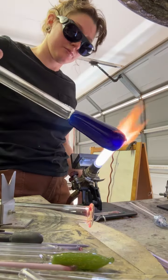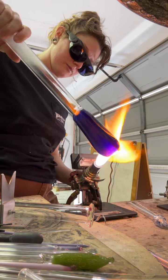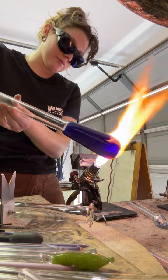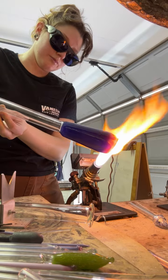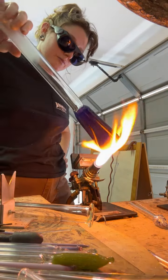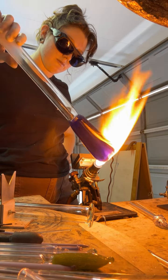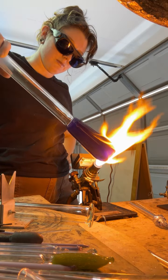All right, so now that it's done, I'm going to put this in the kiln for at least 15 minutes to allow the entirety of this vessel to come up to temperature, because we are about to start smacking this thing with a ton of heat, because at the largest section of this knuckle, it is 3 inches, which is about 76 millimeters thick. It's big, it's heavy, it's hot.